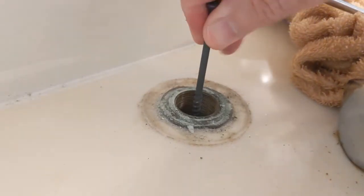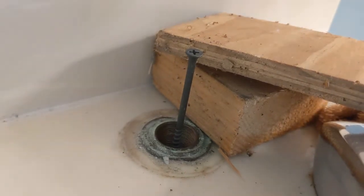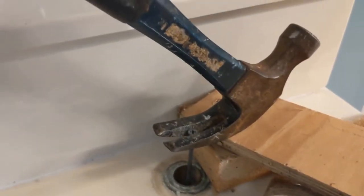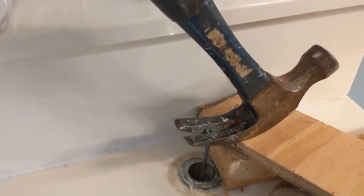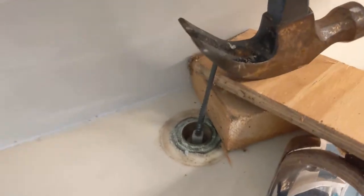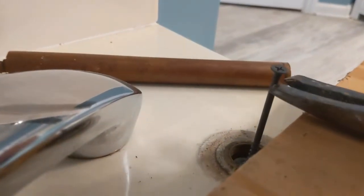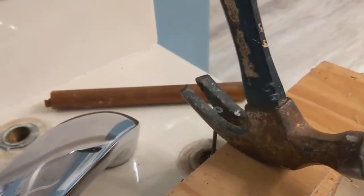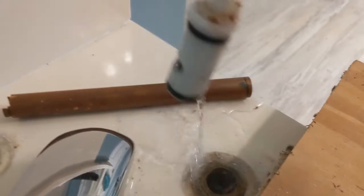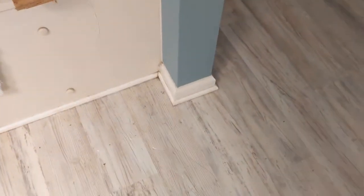To get the old cartridge out, I used a long screw to drill into the top of the old cartridge, then applied a claw hammer with a couple of pieces of wood to raise it up and pull it out as straight as I could. It's not perfectly straight but it came out okay. For the first one, I had released the pressure at the sink valve but hadn't released the pressure in the tub, so when I pulled it out, water came up out of there and onto the floor and I had to run and get a towel — not a huge deal though.